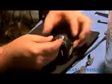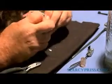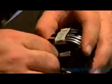This is our jumper. This makes sure that our negative plates are going to be cup number 2 and cup number 5. And that's pretty much the entire fuel cell. There's nothing complicated about it, and the design of the fuel cell itself is absolutely not critical. 2 stainless steel washers in close proximity will actually make enough hydrogen-oxygen gas to do the trick. This is just a very efficient, very interesting design which will make a lot of gas, can be replaced easily, doesn't cost a lot, and it does a marvelous job.